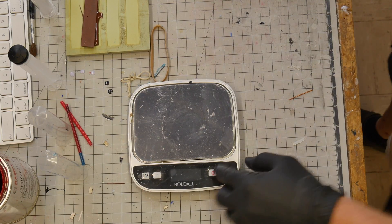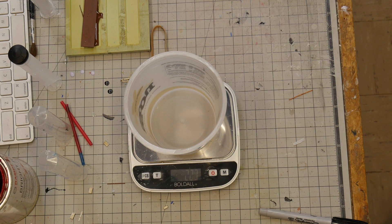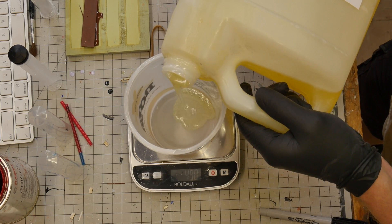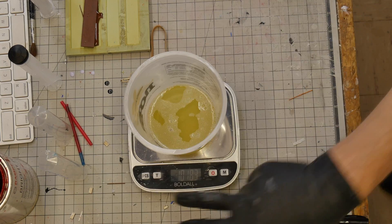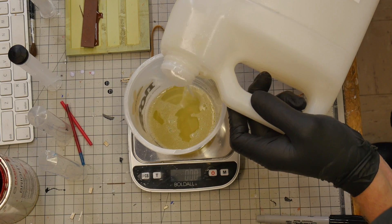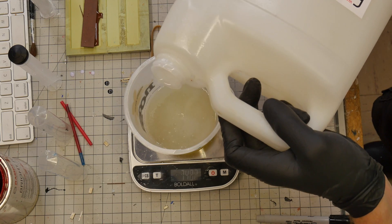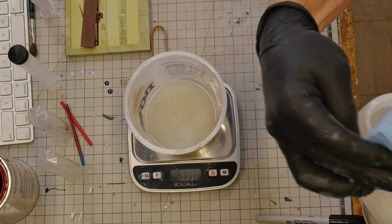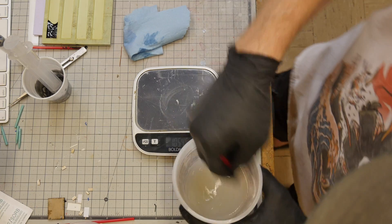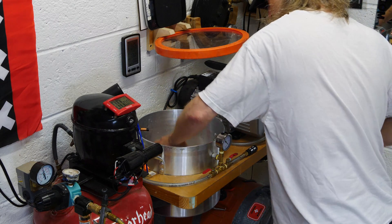Let's mix up some polyurethane resin and make some sample parts. You'll need an excellent two-digit kitchen scale — you need to be able to measure to two tenths of a gram. The resin we're using here is a two-part mixture with a 100 to 92 ratio. Different resins will have different mixing ratios, sometimes one to one. It's important to get this correct so your resin sets up and is not too soft. Mix it very well using a regular straw.